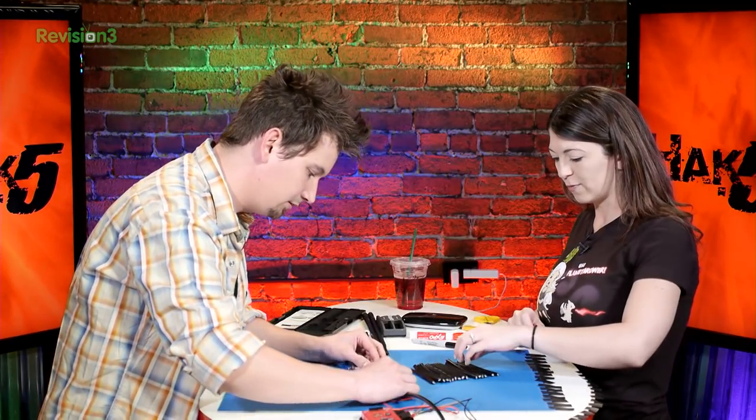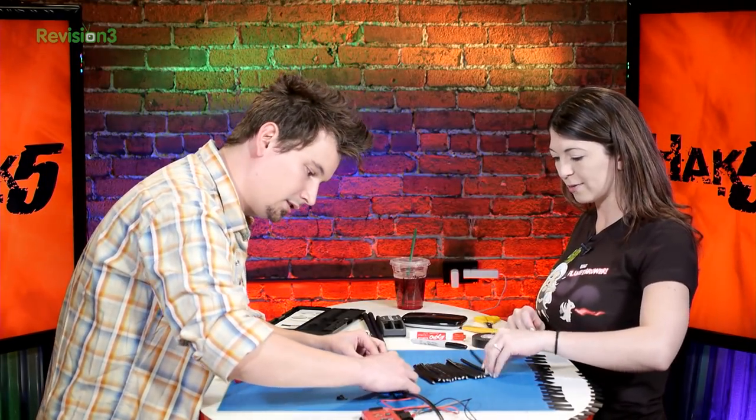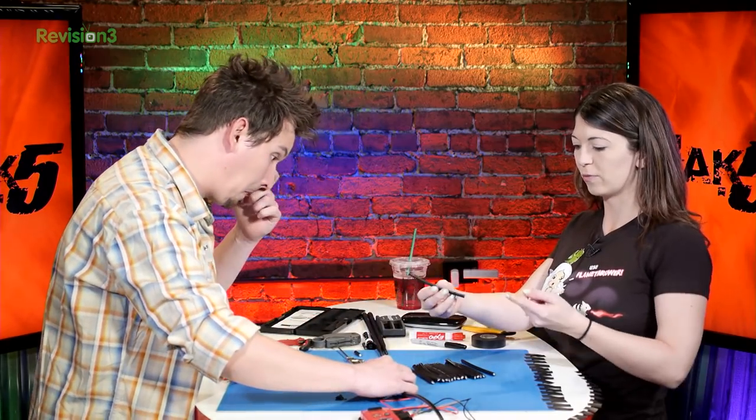So here's a question for you. Why are we doing 16 of these instead of just one really long piece of cable? Well, because each of these is tuned to, in this case, 1090 megahertz, as we just did all the math to figure out. And it's kind of like this.